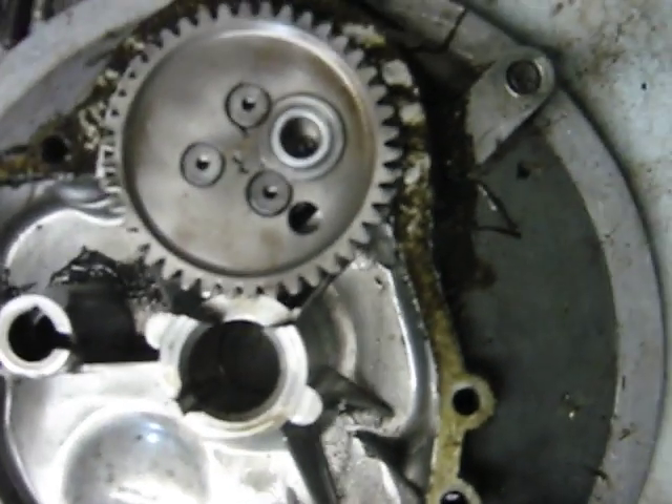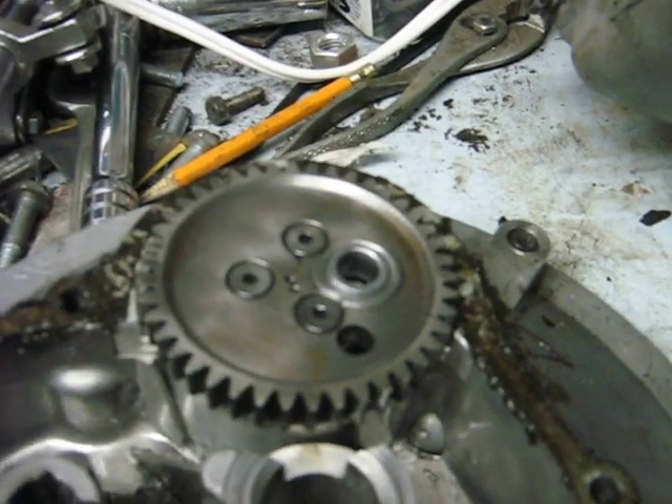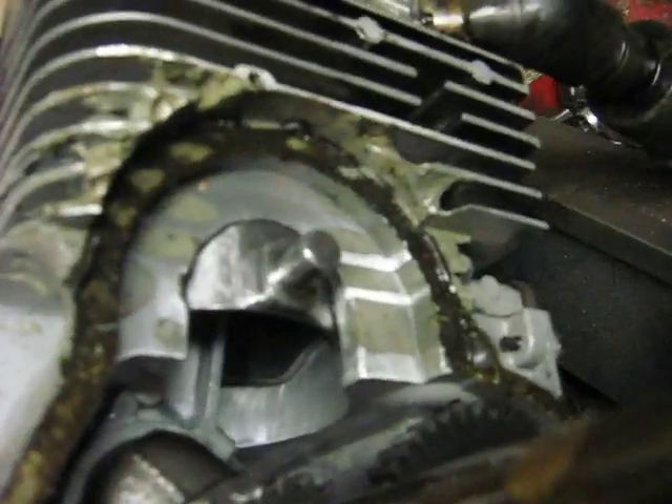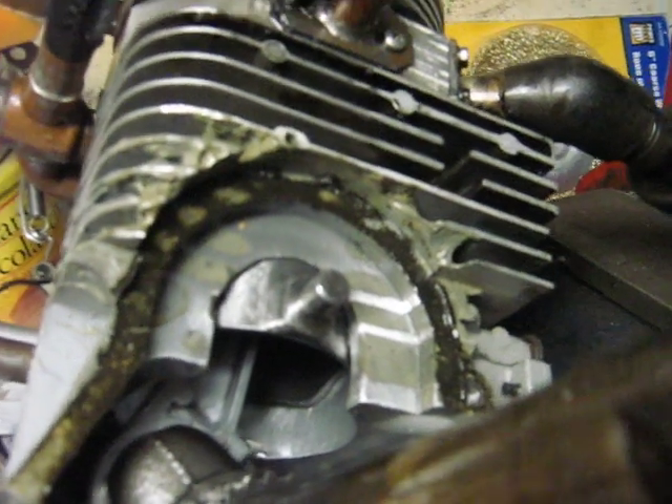There's a relief cut into the gear as well as a relief cut into this face for the sleeve. And here you can see the bottom of the sleeve — sleeve drive pin right there, 3/8 inch diameter.